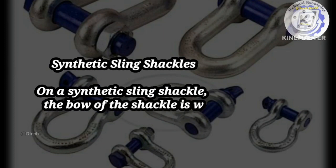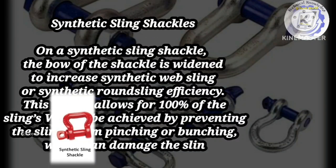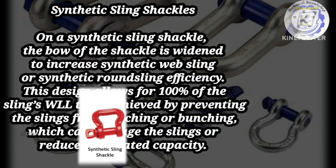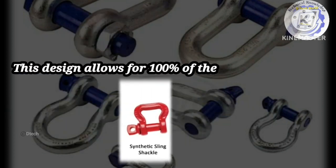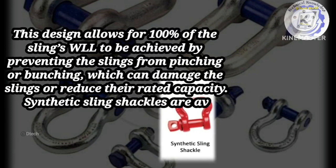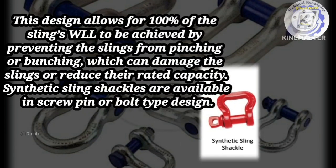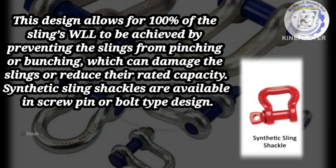Synthetic sling shackles. On a synthetic sling shackle, the bow of the shackle is widened to increase synthetic web sling or synthetic round sling efficiency. This design allows for 100% of the sling's WLL to be achieved by preventing the slings from pinching or bunching, which can damage the slings or reduce their rated capacity. Synthetic sling shackles are available in screw pin or bolt type design.